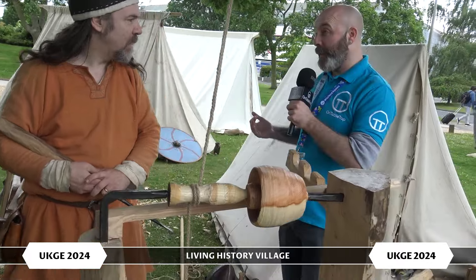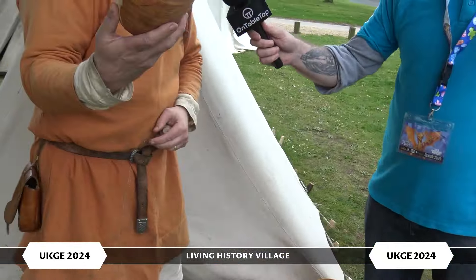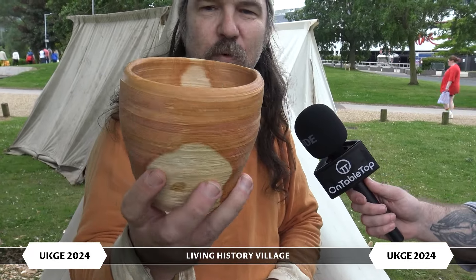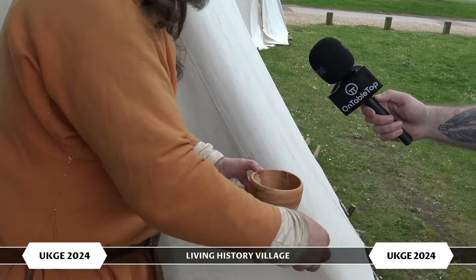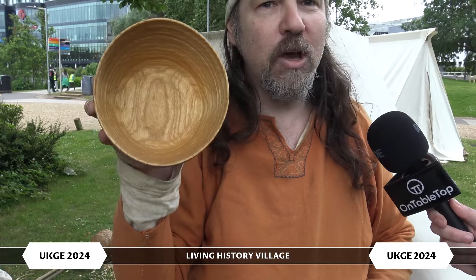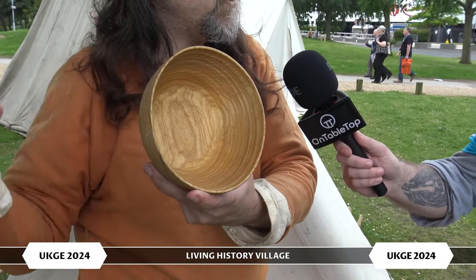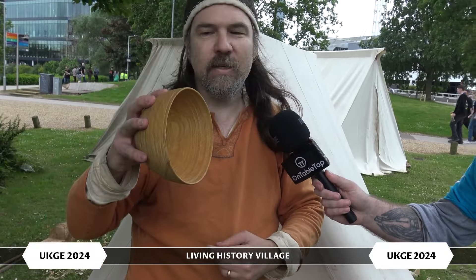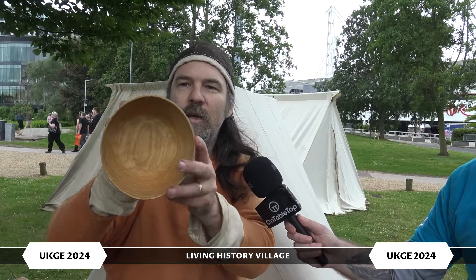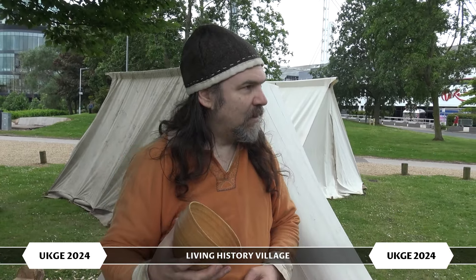All right, I see you've got a few finished pieces over here. So if you want to walk us through what the actual process is for a finished piece. So this is what we're hoping the piece on the lathe will look like — this I turned a few weeks ago from the same log. Okay, so that's what we're aiming for, hopefully without the split. One thing you'll notice about this bowl is that it's no longer round — it now has that oval shape to it. And that tells us, because the finds we get from the Anglo-Saxon period are all oval, that the wood was turned when it was freshly cut. And then the wood shrinks — wood only shrinks in the radius of the tree and not in the height. So it's kind of narrowed on the radius but not on the height, which gives you this oval shape. So as the actual timber cures after cutting, it comes to its final resting place?